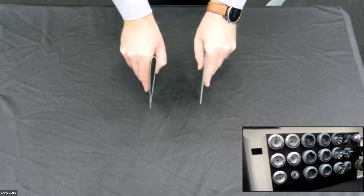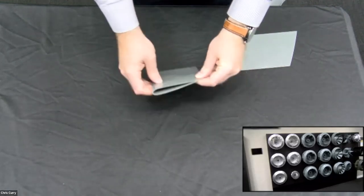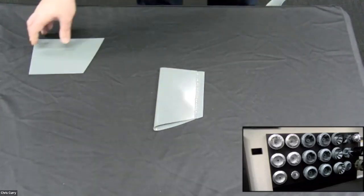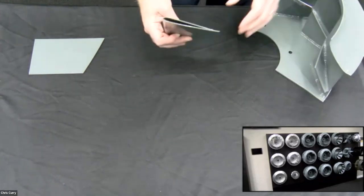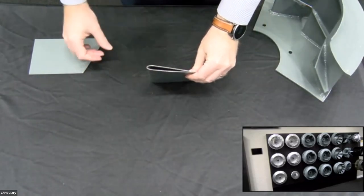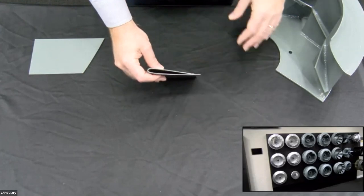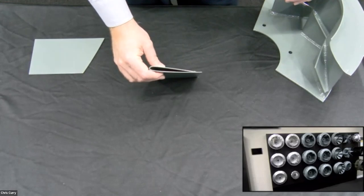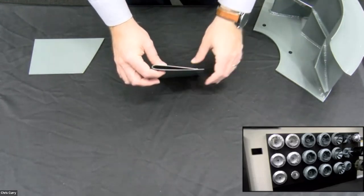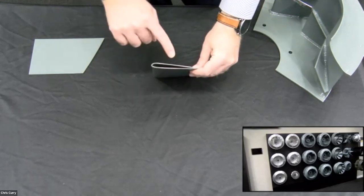So which one is better to use? Well, that is a cost point. This wheel, or wheels that use this, actually are more efficient to use. Okay. Now, when we talk about efficiency, what we're talking about is that because the airfoil creates a slightly better efficiency point inside the wheel to move the air because of the principles of the pressure airfoil. Just like a plane uses this to generate lift, we use it to generate more pressure within the wheel to help move more air.